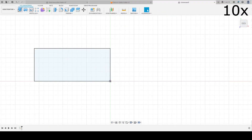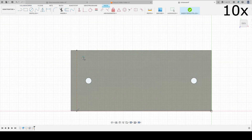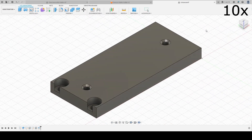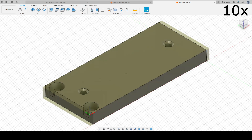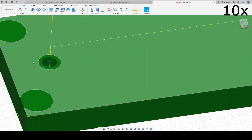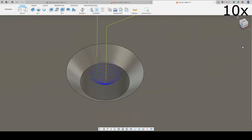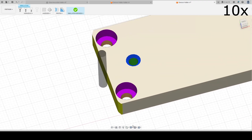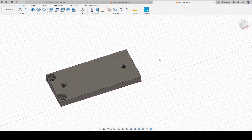For making the mount I need three parts. Here I am making the first part in CAD — this is the part that the slide portion of the linear encoder will mount to. I am using Fusion 360 for my CAD and CAM work because it is the most convenient and I have used it for the last five years. I know it really well, at least the CAD part. The CAM I am still new to because I haven't had the CNC for very long. Here I try to design the part so I only need one end mill and don't need a tool change.